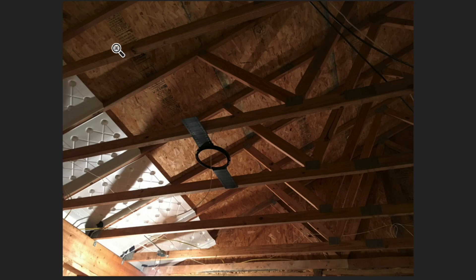Put some speakers in the ceiling, thinking it'd be nice to have some music. My advice if you're going to do something like this and you've got the drywall not in yet: run any kind of wire you can think of, because wire is not that expensive. But fussing around trying to run it behind drywall that's already in is sure long work.